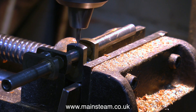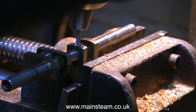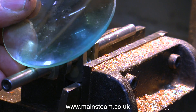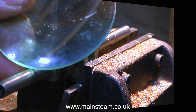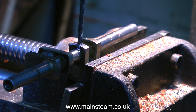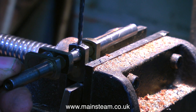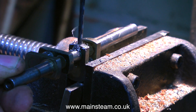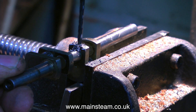And it's over now to the drilling machine to drill out the peg. The crankshaft is very loose at this point, so I need to remove the peg. Here I'm using a magnifying glass to make sure that the center drill is exactly in the middle of the peg. So with a nice neat center drilled hole in the center of the peg, I can replace the center drill with a 1/8th twist drill and drill all the way down. I'm being very careful with this process because if the drill was to break in the work, then the crankshaft is scrap.